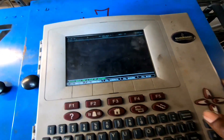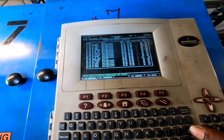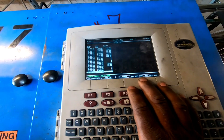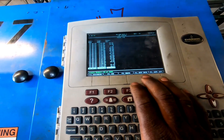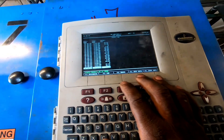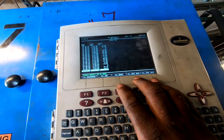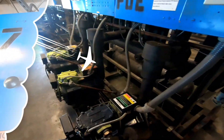Case 746 — we're going to log it and see if this EPR ever closes. If it never reaches zero, refrigeration could be on all day, constantly feeding refrigerant and causing it to freeze up early. Ideally, if the case is working right and the superheat is working right, the case should come down to temperature, the EPR valve should close, and it should reduce the load on this rack and some compressors should shut off.